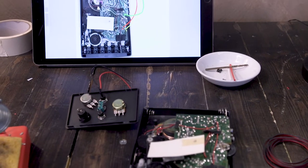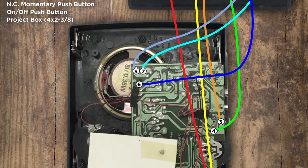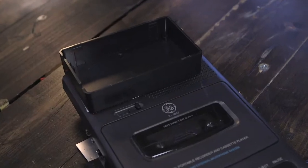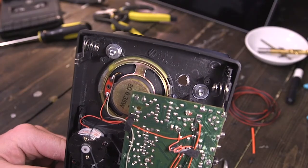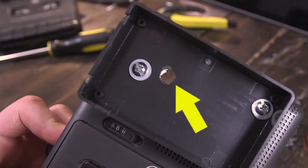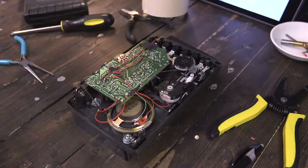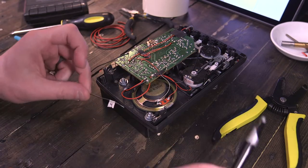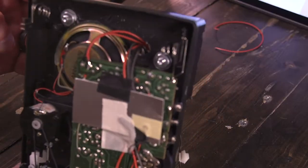Now I move to soldering. For the wire connections, I made a little schematic for reference — I'll link to this below. I put some liquid nails on the project box and fastened it to the cassette player with a few short screws. It's important to place these in a spot that won't bump against any of the button terminals when the lid is closed. I also drill a hole for feeding the wires from the circuit board through to the box. Now I move on to the board connections on the cassette player, and one by one get all the connections soldered up according to the diagram. I label all my wires with a number that corresponds to the wiring schematic and feed them through to the project enclosure box.